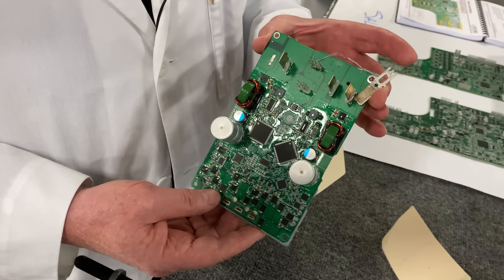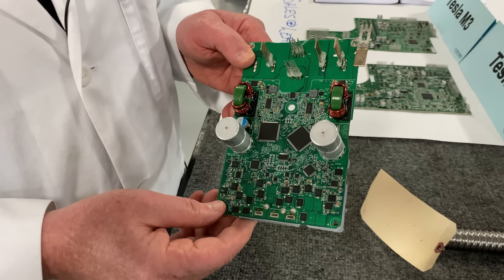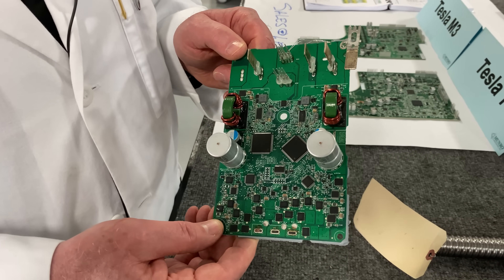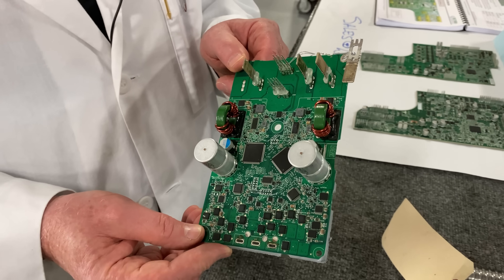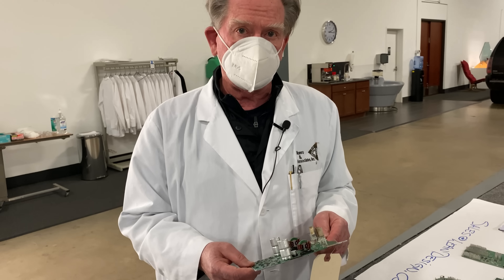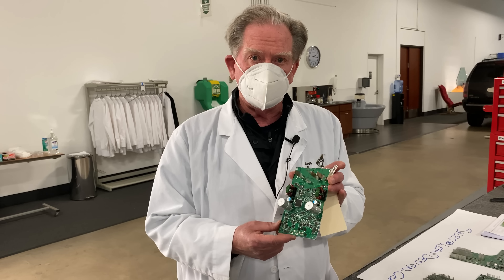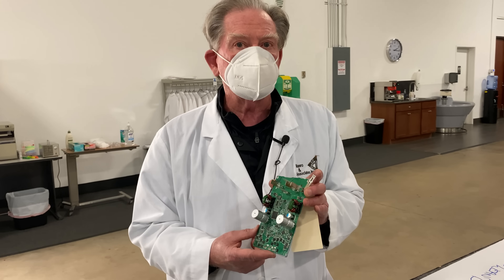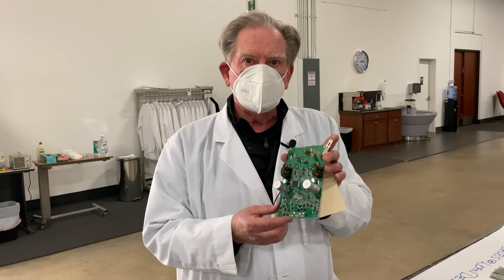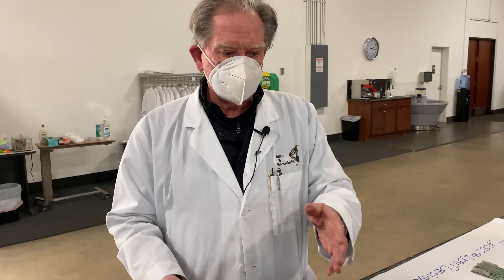This is the controller board for the steering system. What's interesting is if you cut it right down the middle, you'll see that half the board and this half of the board are basically populated twice — that means this is a redundant system. A redundant system is like what you have on an airplane: if one thing goes down, something else comes in to take its place. This is exactly that type of design. A redundant design for steering is a really good situation — you can never tell when a sensor goes out or part of the board has a problem. This thing has double of everything.